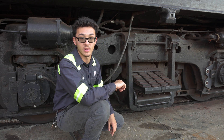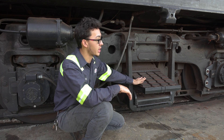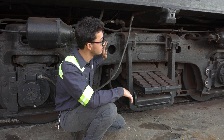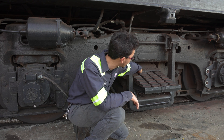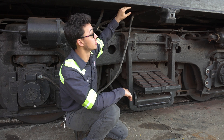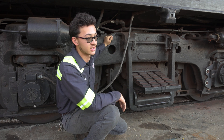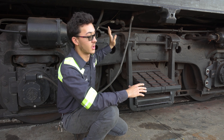There are also different components of the bracket on the truck that allow the locomotive to go up and down and side to side as it goes down the track. The leaf spring is responsible for the up and down motion of the locomotive body — the chassis and the frame — not the truck or the axles. There are different components on the truck that allow each individual component to move separately.